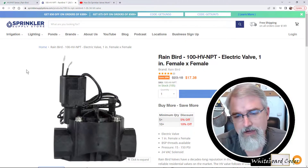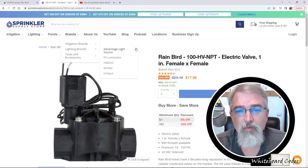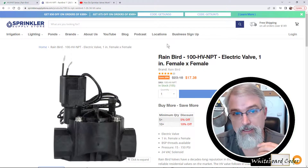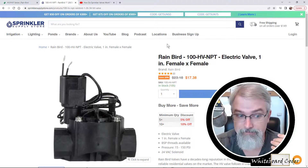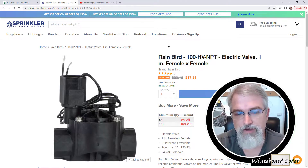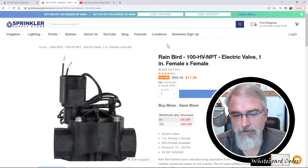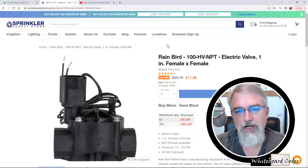What I have occurring right now — it just started here, it was occurring a little bit last year and now it's kind of just full-blown happening all the time on one of my sprinkler heads. Just one; all the rest are fine. If I turn it on electronically, the solenoid will go, the valve will turn on, everything works just fine. However, it will not shut down. Last year it was every so often — my wife could probably tell me better because she's the sprinkler goddess — it would not shut off.